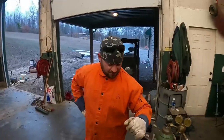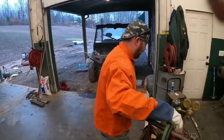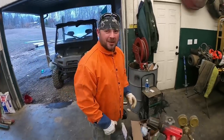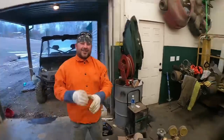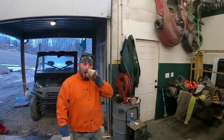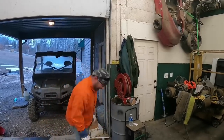You gonna explain to us what an air lance is, Mr. Behind the Scenes? Well, an air lance is a little bit safer than a torch because it'll cut straight through and won't veer off and get into the main housing. Well, it'll cut as straight as you shove that rod in there. Exactly. It cuts as straight as the operator, but you have control. So are you trying to say you have control over the penetration? Yes, I do have control of that.